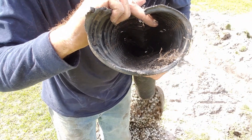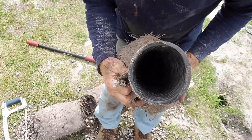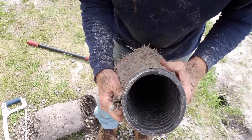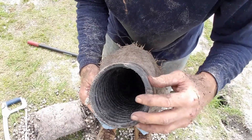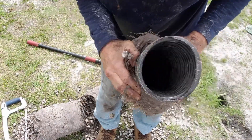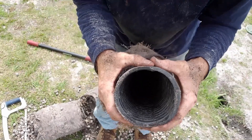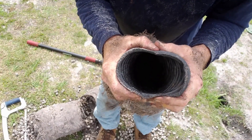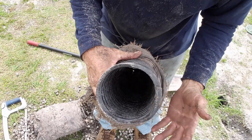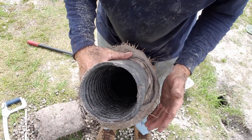It is super clean inside there - the fabric definitely keeps the sand out. The aggregate works good. You can see this pipe is wide open. There are some grass roots that are getting through there, but look at the condition of the pipe - that is perfectly round still. There are some places that were a little collapsed, out of round, because this pipe is not that strong and it's not supposed to be in the driveway. But that's where it's at, and it's a great example of just how well NDS quick drain actually works. It's much stronger than you think.